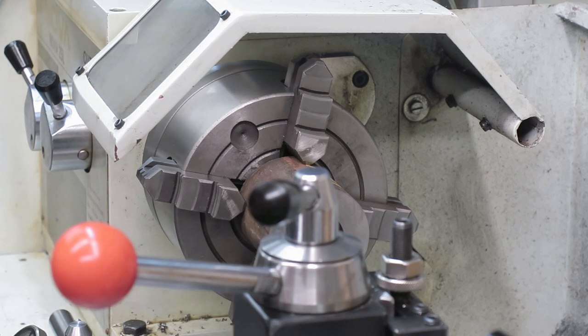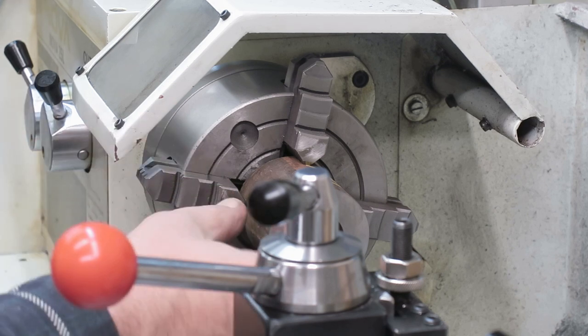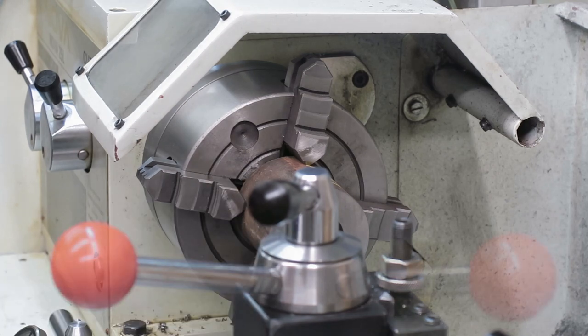And the correct diameter, according to this black book, there we are. 28 millimeters is the recommended tap drill. So it's a hair under 28, was it? Did I say? Yeah. So we are there. That's it. That's our minor diameter. No more boring.